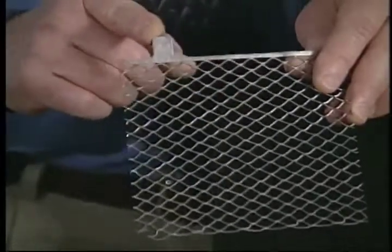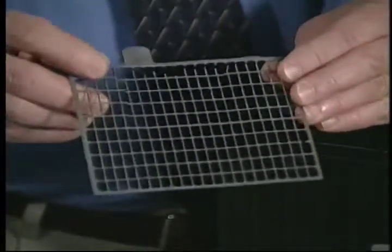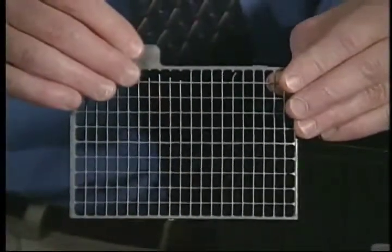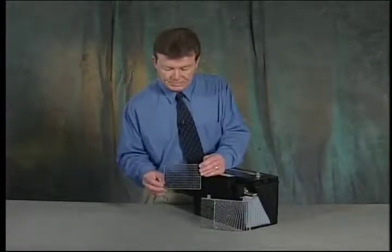The wires have a zigzag pattern as opposed to being directly towards the lug, which is important for reducing grid resistance and improving startability. Some manufacturers utilize a cast grid that is very light, quite fragile, and flimsy. As you can see, these wires do not radiate towards the lug. They're done for the lightest weight grid design and the least amount of material that they can use to get away with this particular type grid design.